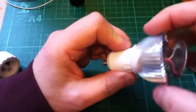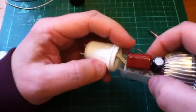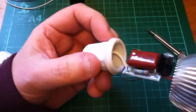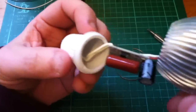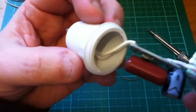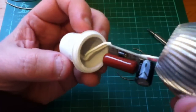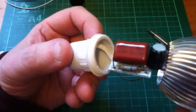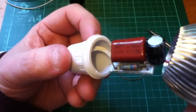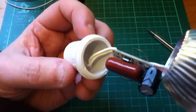If we unscrew the heatsink, and you can pull out this sort of peculiar plastic tray which drops away, and then you have this sort of classic mains dropper circuit. And what's in there is, you can just see it shining there, the bridge rectifier, and then there's a resistor, that's 360k, there's a big capacitor, 1106 that says, it's 400 volt, and then there's an electrolytic smoothing capacitor, also 400 volt.